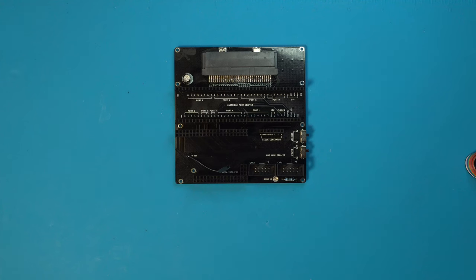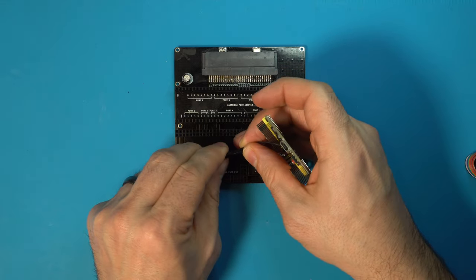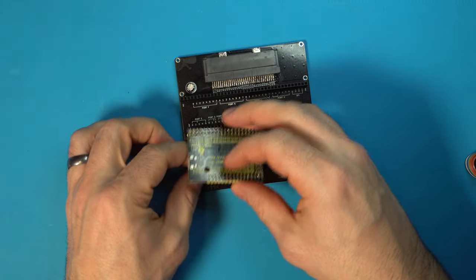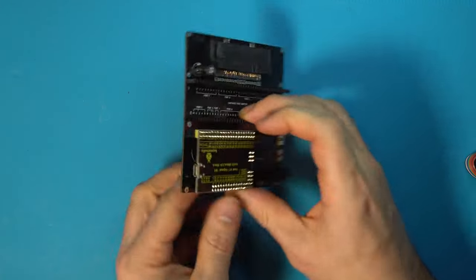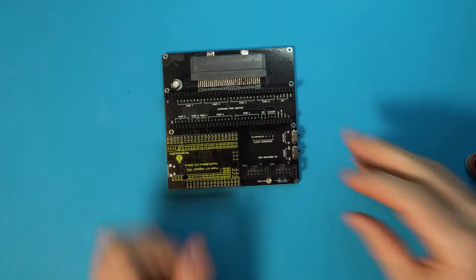With soldering on the lower board and the associated components complete, we can go ahead and assemble this and program our Arduino. So let's go ahead and connect power and make sure this is a good solid connection. Now when we install this, we want to make sure that none of these wires are going to get caught. So let's make sure that those are out of the way and all the pins are aligned. We can go ahead and push that down in. There we go. Make sure that's nice and snug with the USB port facing out.